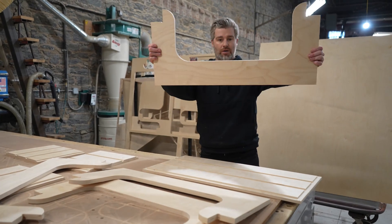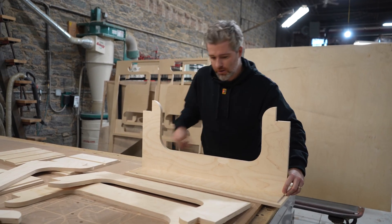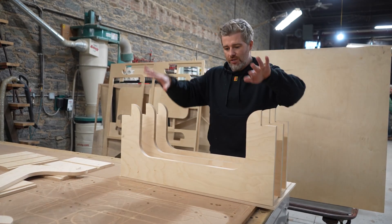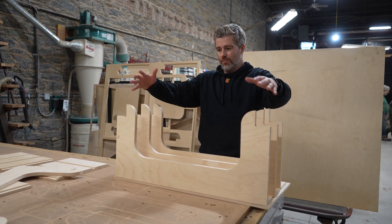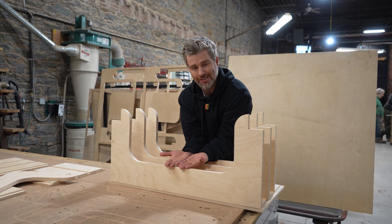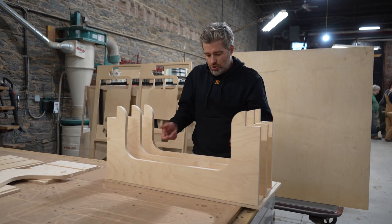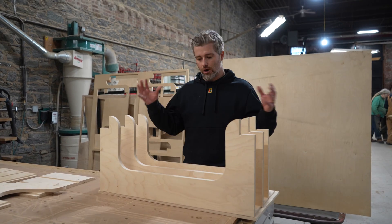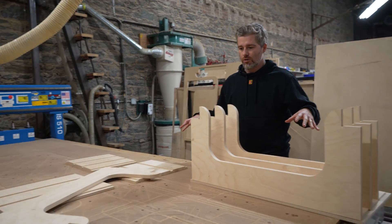This is going to be part of the shape we're creating — it's made out of a series of plywood ribs, something like this, and then we have a smaller piece that goes in the middle. We'll put layers and layers of plywood here with glue in between them, then we'll get another U-shape and press it down. The piece is going to be compressed inside this jig, left there overnight, and once we take it off we should be able to pop out this super thin piece of laminated plywood — that's how the furniture piece is going to look.